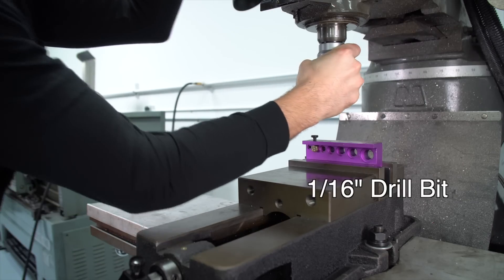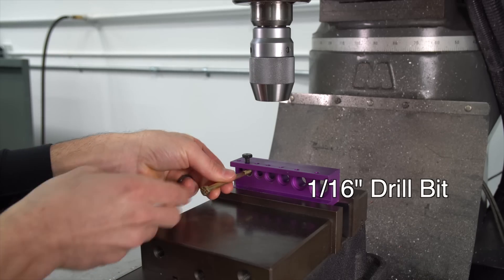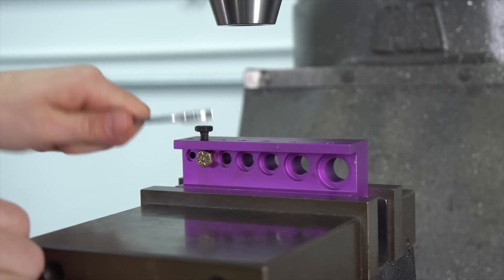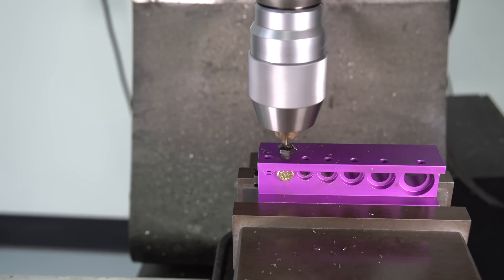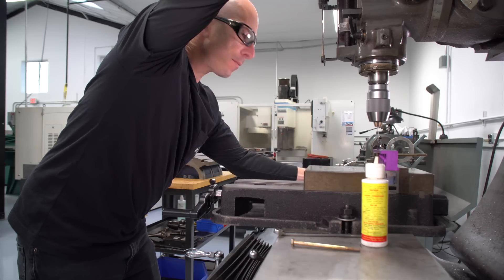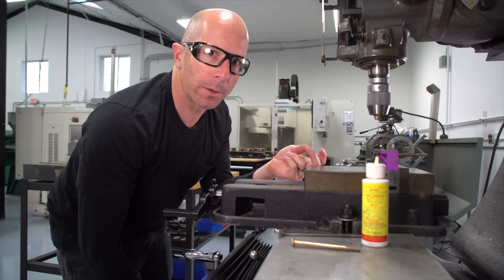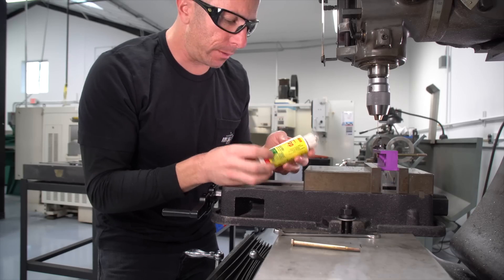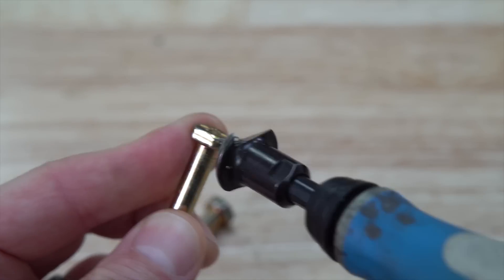Now we're over here at the mill and everything is set up. We're going to drill both of these bolts, and once they're both drilled we'll install them on the engine and safety wire them up. I'll install the bolt into the fixture, lock it down, and go ahead and drill it. I'm putting a little bit of oil so it drills nicely into the steel bolt, and then I'll keep pecking it — going up and down each time to pull out a little bit of material and clear the chips. Run the drill bit pretty fast — I'm running at about 2500 RPM. The smaller the diameter, the higher you need to run the speed because the surface speed is slower on a smaller diameter. The oil I'm using is called Rapid Tap; pretty much any cutting fluid would work, but this is what we have around the shop. Now they're both drilled — we'll deburr them, put them in the engine, torque them up, and install the safety wire.